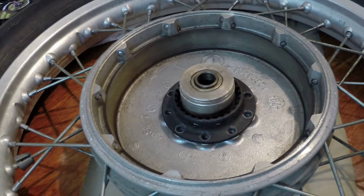I'll try to summarize and give some tips on a couple of things that I did that seemed to help. These are steel rivets in an aluminum hub, and you're going to be basically drilling out these rivets. You want to drill out the rivets from the driving dog's side, mainly because if the drill slips, you don't want to damage the aluminum, and you'll be throwing away this driving dog anyway. The first step is to use a punch and make an indentation on the top of the rivet.